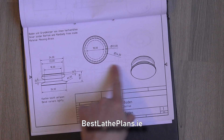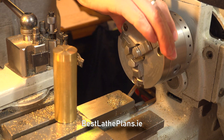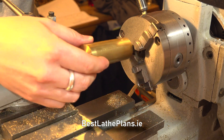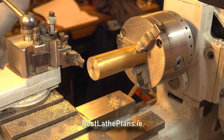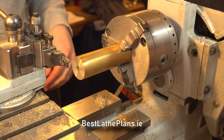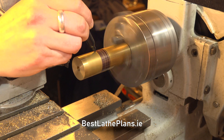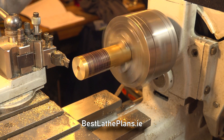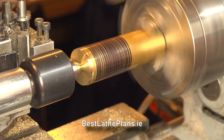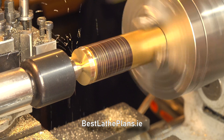So please follow me over to the lathe and let's begin machining. Here we are at the lathe and this is the brass stock I will be using for the body and the base. I am mounting it in the three jaw chuck and as you can see I have not prepared the surface which will be held by the chuck — unfortunately this will become very relevant a bit later on. As always I add some sharpie to the stock so that my markings can be made a bit clearer. Here you can see me take a light surface cut down the length of the material, marking the correct length, and then taking a measurement of the diameter.